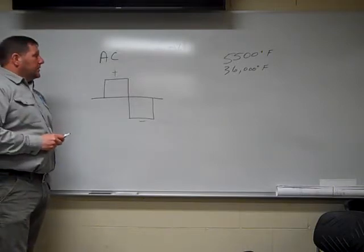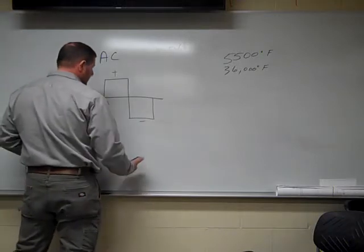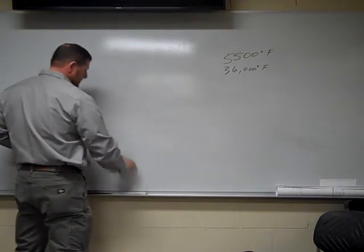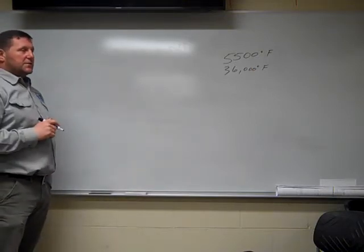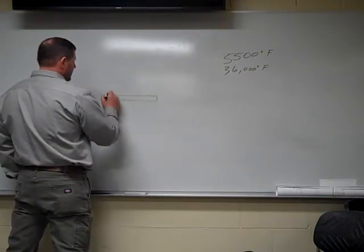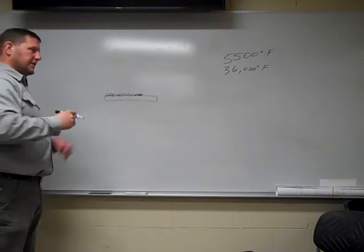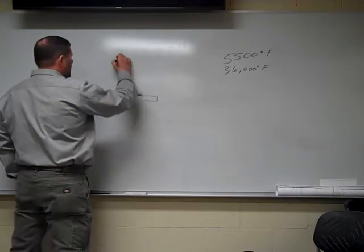Now, when you actually get into the lab and you start welding, there's a thing called arc blow. Chapter 3 gets into a lot of technical terms about the welding power sources. I'm not going to dive into that. I want you to understand what the currents are and a few of the things that you may encounter in the lab. So for example, I'm just putting a bead on a plate. You get about three quarters of the way through, and all of a sudden your welder starts acting really weird. You get a lot of spatter, your arc isn't maintained as well. Well, they call that arc blow.